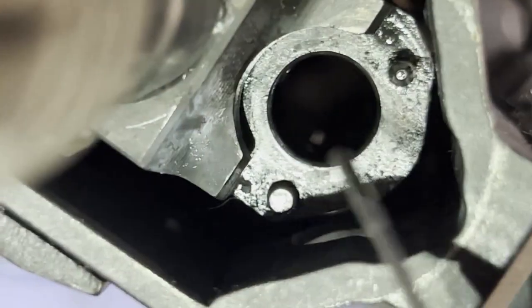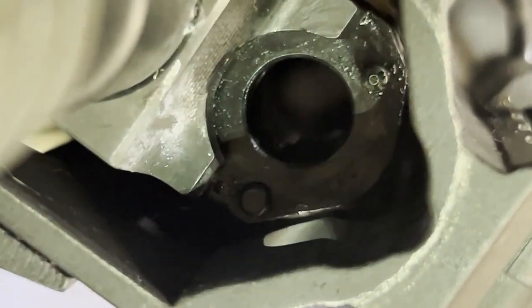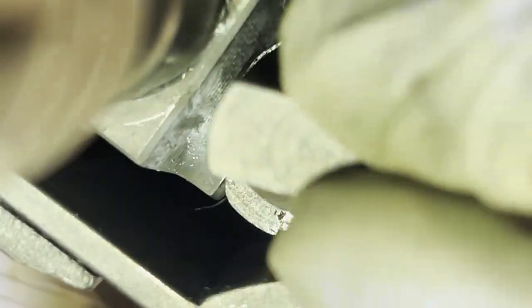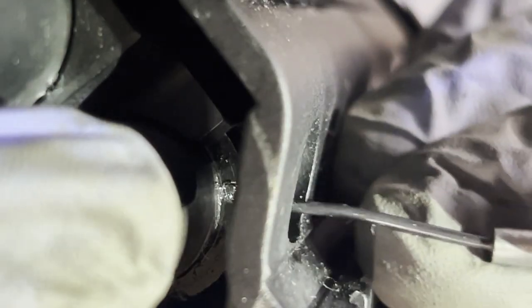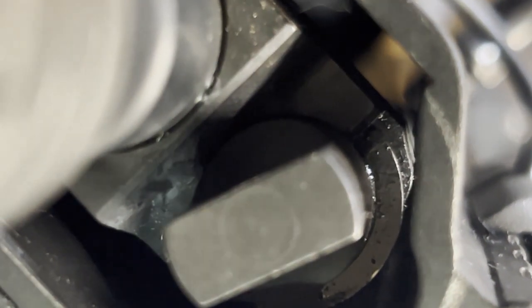Just clean all this out really well. We just did it earlier and put some oil on — it still looks kind of nasty, but it's fine, it's going to get dirty again. Make sure your detent isn't stuck. After that, you're just going to return this back to where it was — position four — work that little detent back down. And then you'll be able to move that to the other positions again: three, two, and one.